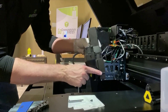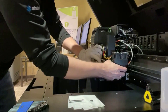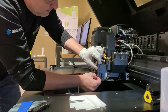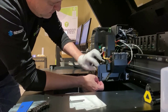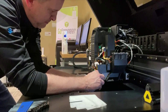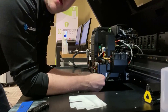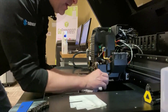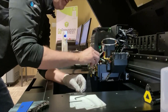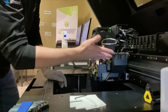We'll take our UV light — there's a tab in the back of the UV lamp. Here's where the screw goes; the tab will slot into that location. Take the screw and start it in. Snug that up, then reattach the electrical connectors. Everybody's attached — those are for the lights and the fans. Everybody's plugged back into place.